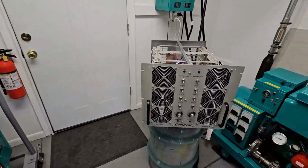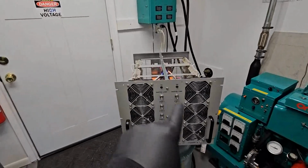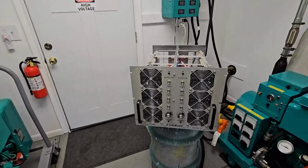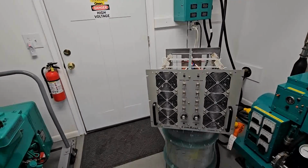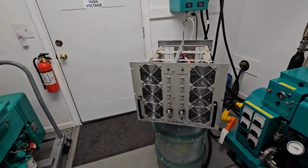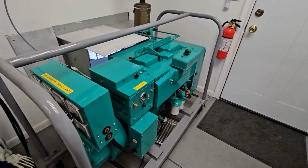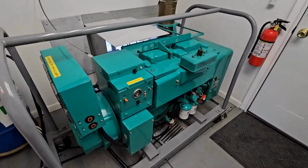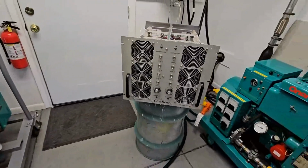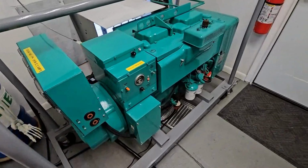As you saw when we powered this up, we only had a few watts. That was basically this running. I incremented the load. We got up to 5.5 kilowatts per channel per leg, so a total of about 10,500 watts, I guess, roughly, for this DJC. Again, we've got a 15 kilowatt head, so it was no problem. You heard no hunting whatsoever as I was flipping the switches in between and full load, the whole nine yards. The thing performed excellent.